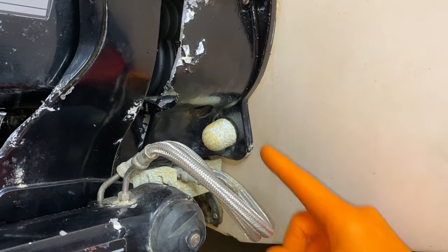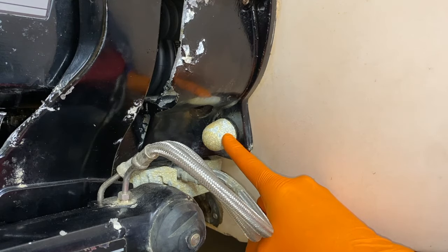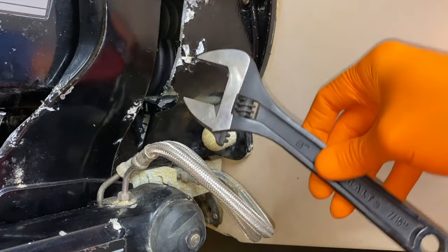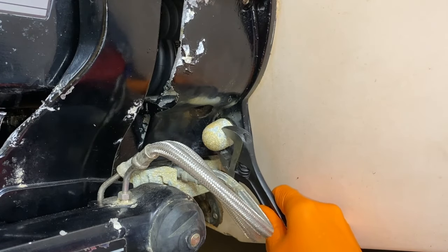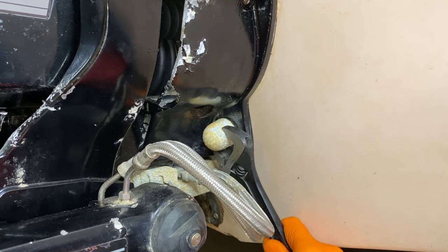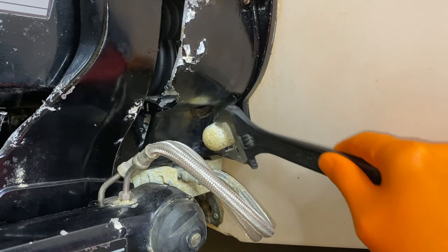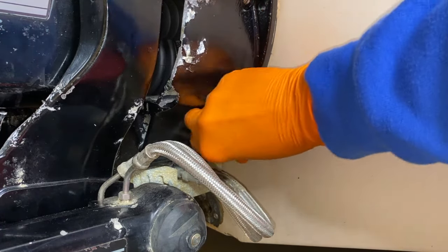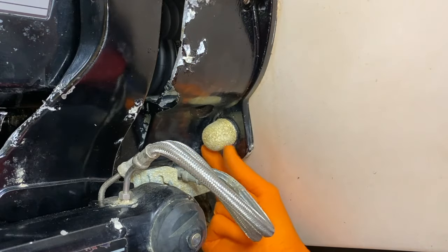We're now moving inward toward the hull of the boat. Down below is the larger bell housing anode. And just above that, on both starboard side and port side, you have these little rounded anodes for the transom plate itself. Go ahead and grab an adjustable wrench, measure it up to the flat surfaces of the anode, and counterclockwise turn to loosen them. Go slow — no need to rush this part. And if you're lucky, just breaking it free, you might be able to loosen it by hand, which I can, and it's coming off pretty nicely.